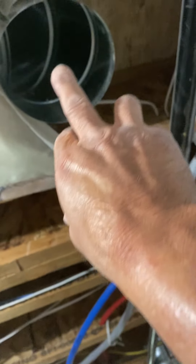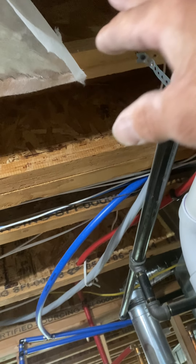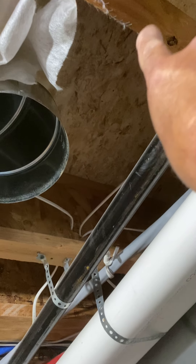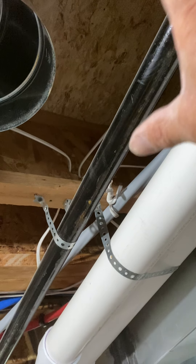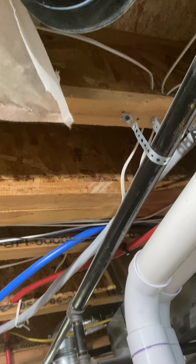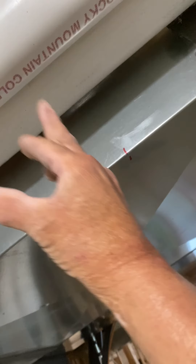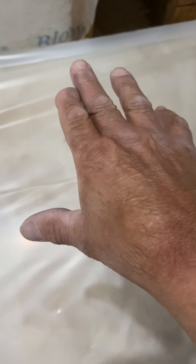So now we're going to be tight to the ceiling. Notice the combustion air right here, so you may have to scoot this over this way — and maybe in here a little bit depending on what that offset does. I told them we wouldn't cover it, but our duct is going to be right here, so you do have room next to it. Anyway, the duct is going to come out and go out here towards the wall.